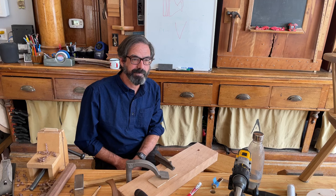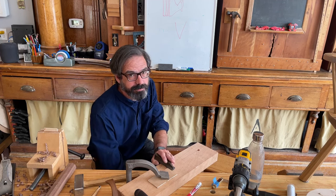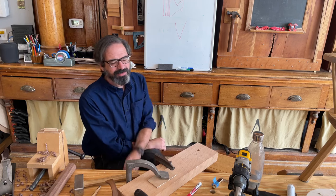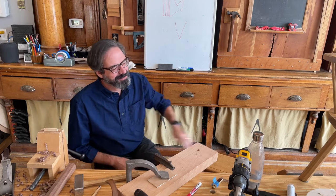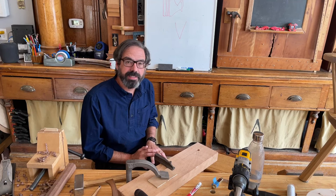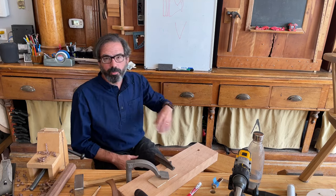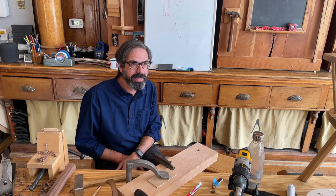If I'm only making a chair once, how can I make sure it's comfortable for the intended person? My earlier discussion holds: study an existing comfortable wooden chair and copy that. Even if you're not copying the style, copy where it touches the human body — what is the seat tilt, where is the lumbar support, where does it hit the shoulders, how high are the arms. Find a comfortable Windsor chair or similar and make a copy of those ergonomic dimensions.